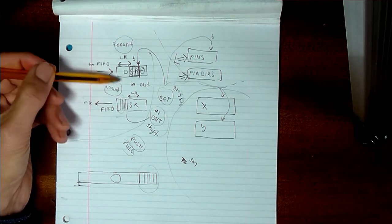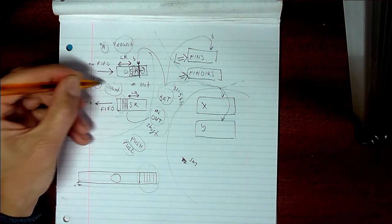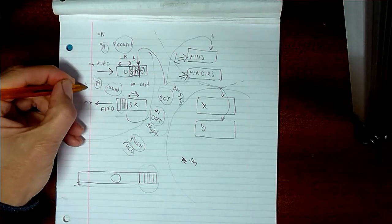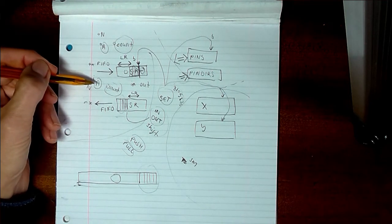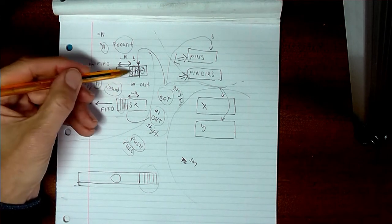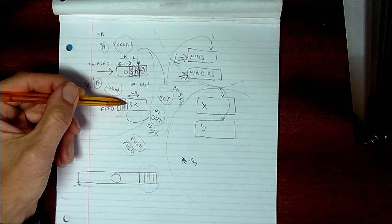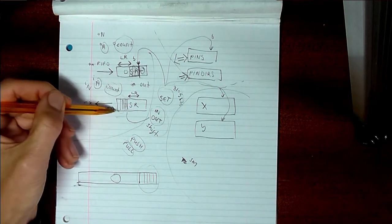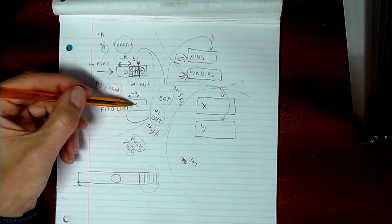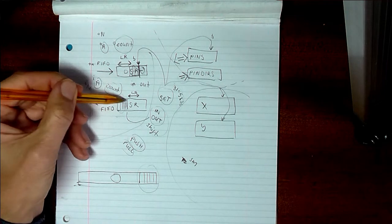But you can also set these, they have got a flag as well, let's call it the auto flag. That was going to be your output auto, and that was going to be your input auto. And as well as there being a flag, there's also a number associated with that flag. And that number is the number that the count needs to reach before an automatic push or pull occurs. So if we set the number at 1, it would mean every 1 bit that we shift into the output shift register, or every 1 bit that we shift into the input shift register, as soon as the count gets to 1, it pushes that number onto the FIFO and clears the input shift register. But if we had the number set to 32 and it was on auto, it would have to wait until all 32 bits had been pushed into the input shift register, and then it would automatically push out and then clear the register.